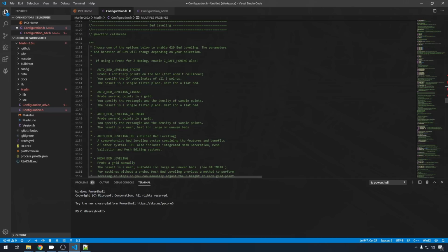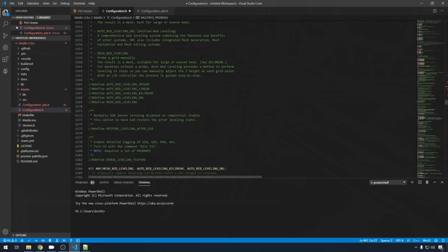For this video, we're going to do one of the most common types of leveling, and that's bilinear. There are a handful of other types. I have videos for a lot of these, but bilinear does a pretty good job, and it's pretty easy to set up. So we're going to uncomment auto bed leveling bilinear.